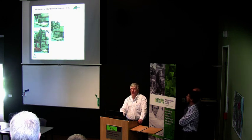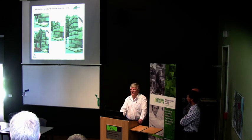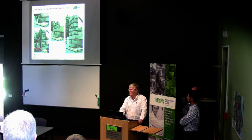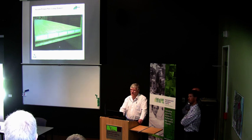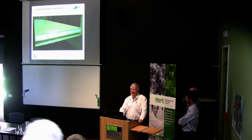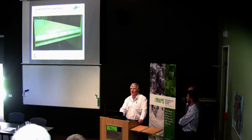The forklift driver had a panic attack thinking he'd be showered with concrete blocks, so he insisted on having a glut put in the middle — but there was still 25mm of daylight over that glut. Even fully loaded, there's plenty of clearance. Those joists were 125mm by 35mm, so you can see that box beam construction like this is massively strong. It gives you the opportunity to run services through the cavity or put in insulation. In this case there's a batten and another CLT panel below to give a separate ceiling, which helps with fire ratings and acoustics.